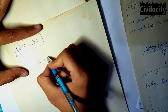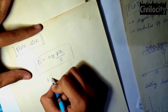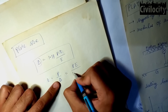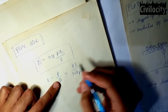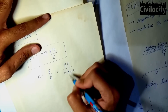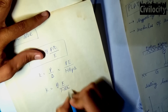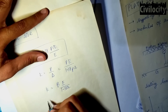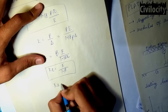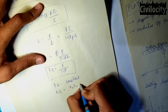There is a theoretical relationship for deformation under a rigid plate of radius r, given as: delta = 1.18 × P × r / E, where E is the modulus of elasticity for the soil specimen, r is the radius of the plate, and delta is the settlement. Since K = P / delta, substituting the expression for delta gives K = E / (1.18 × r). Rearranging, K × r = E / 1.18. Since E and 1.18 are both constants for a particular soil, K × r = constant, meaning K₁r₁ = K₂r₂.